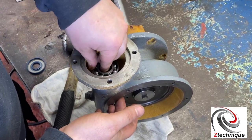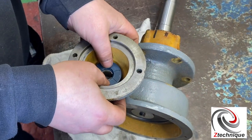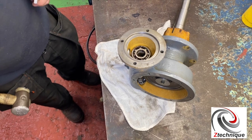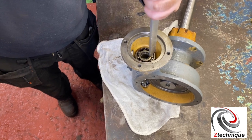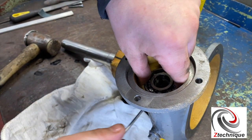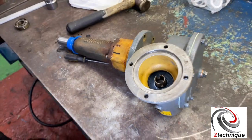The next stage is to pop the other bearing in. There's no particular way it needs to go — good practice to have the numbers outside — but you can just pop that in. And finally the oil seal. We're using the old bearing just to seat the oil seal down correctly, and we're just going to tap it down. The oil seal is now in its final position. You can retrieve the old bearing by going through the side and wiggling it out. You can see the oil seal is correctly centered and seated. Get the seal in to the point where the circlip goes in — the next action is fitting the circlip.